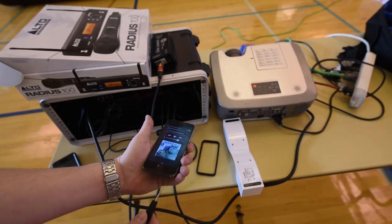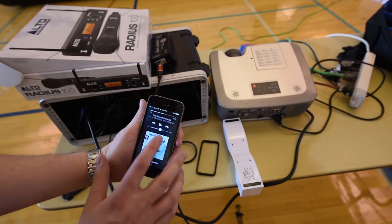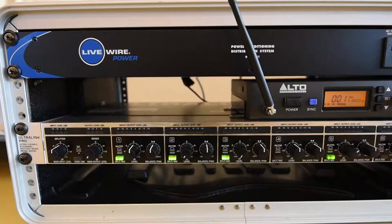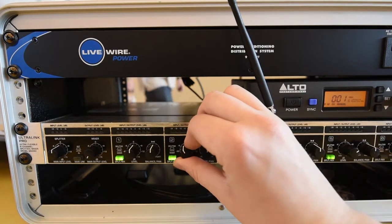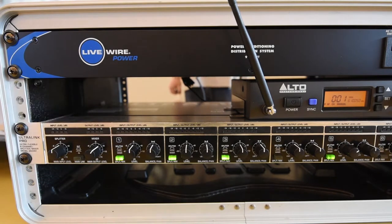For using an iPhone or device with a headphone jack, plug in the auxiliary cord into the device and press play. On the front side of the mixer, channels two and three represent the left and right channels of the auxiliary cord. The master volume can be increased to a desired level. Make sure not to have the output level flash in the red.